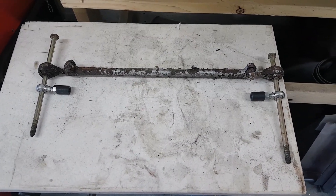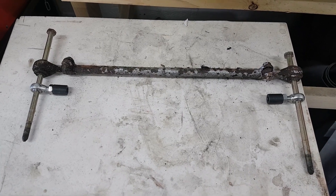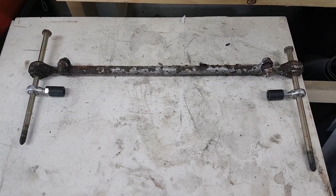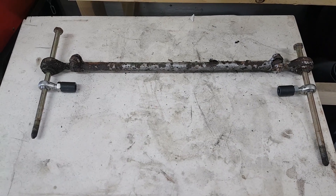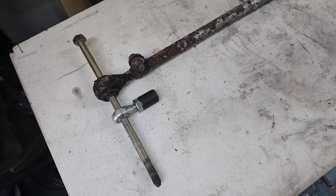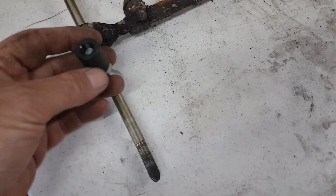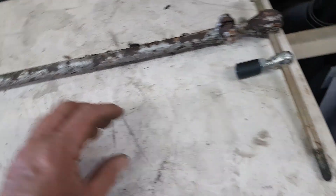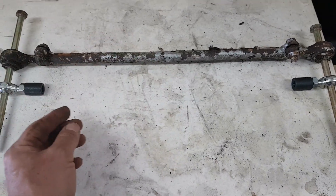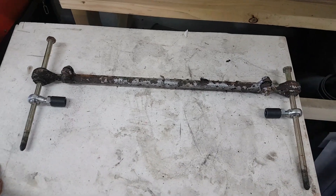This is the original arm. I've just dropped two of the long bolts through — these are the diff carrier bolts — just so we can give ourselves a little bit of setting out. That original arm hasn't been adjusted at all; it's as it was when it came off the car. When we put rose joints on it we are going to get a bit of adjustment, same as the original model has. Each end of the rose joint basically goes into a threaded insert, and the threaded insert can be welded into a piece of tube. You have to make sure you get a left-hand thread at one end and a right-hand thread at the corresponding opposite end. Then all you need to do is twizzle the tube in between — one end will go out and the other end will go out, or turn it the other way and they'll both come in. That's how you adjust your track to get the toe in and toe out.